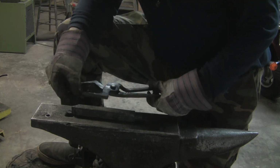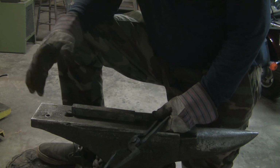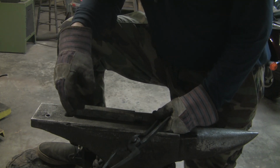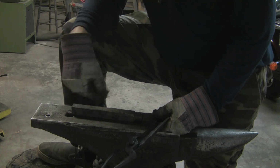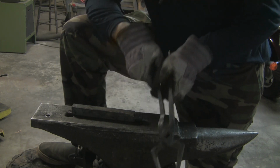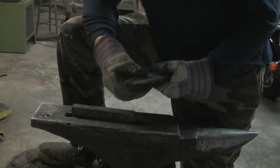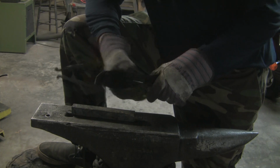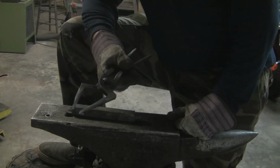They're all made out of that same, not railroad, they're all made out of that same forklift tine metal. So they are very tough, but there was a learning curve there. The first set I did, I got them forged out, everything looked great, stuck them down in the water to get the jaws working, and pretty much just blew the bolster apart. So that's when I realized it was high carbon steel, and not to do that no more.